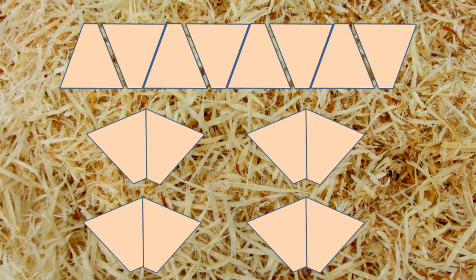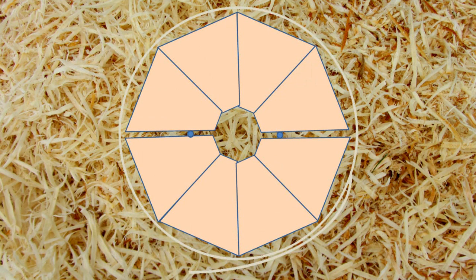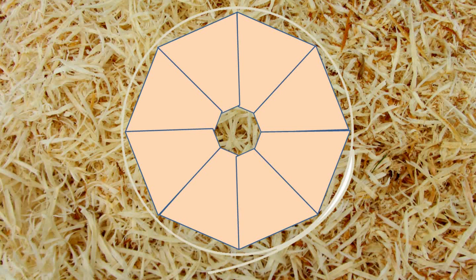Extended time is not necessary for this size of ring. After the pairs set, I glued them into semicircles, separating each half with a couple of small pieces of wood. These pieces take up the inevitable slop. A large band clamp from an automotive store provides clamping pressure. After the glue set again, I sanded the faces to eliminate gaps and glued the two half rings into full rings with the same band clamps. After each was dry, I sanded the faces smooth.